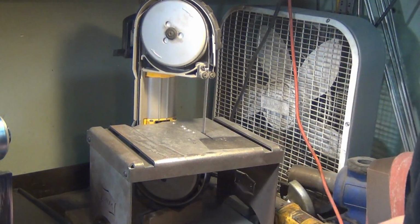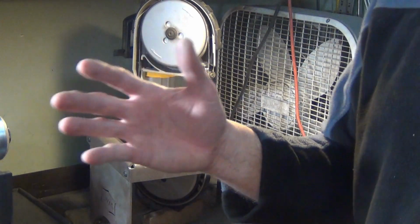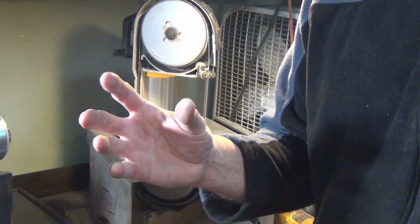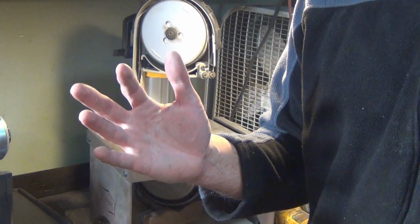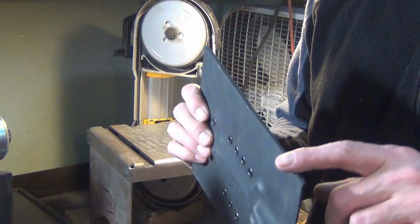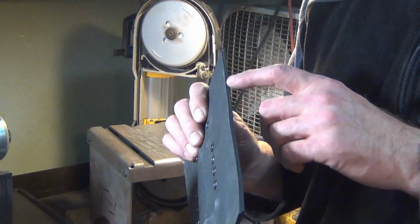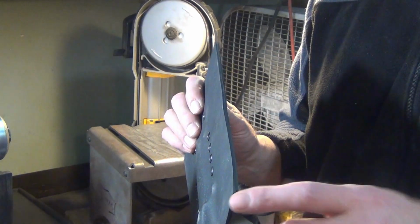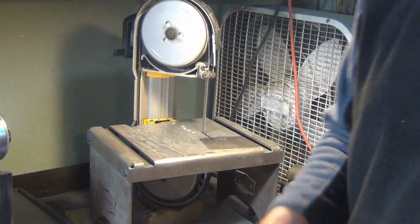Again, when you do grinding, make sure you use the sharpest or newer belt first. You don't want to melt the Kydex. You want to burn it off or sand it off. If you use belts that are too worn out, you wind up melting it and you wind up getting plastic buildup in between your Kydex sheets, which makes a big mess. So.